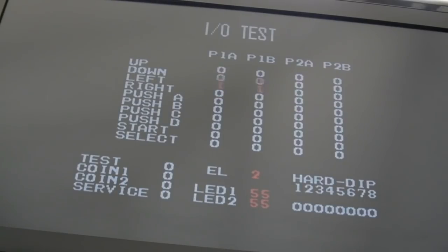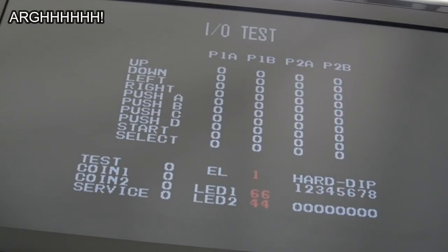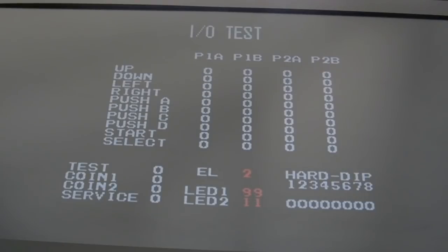Left, right, up, down, A, B, C, D, all together. And select, and obviously if I press start, that works, because we've gone around the controls, we went to the next page by pressing start. And if I unplug the controller and plug it into the other port, it's always a useful test just to make sure that both work. Left, right. Right and up's not working. That's worrying. Why is right and up not working? So I'll investigate that controller problem further in a minute.